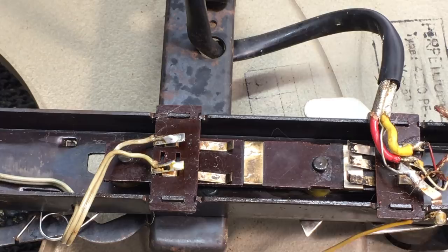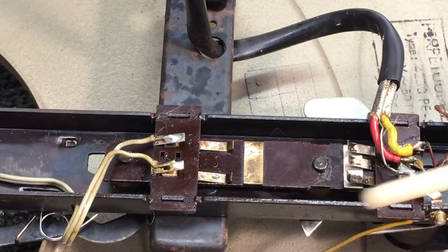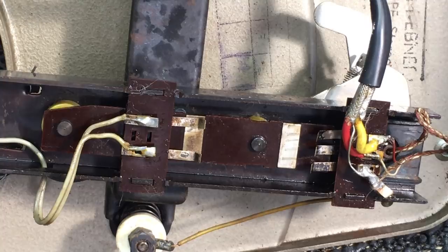Goes down into the shaft over there. So when this turntable is not turning, when it's off, the signal from the gramophone is actually shorted to ground, so you don't have any noise going into your gramophone input of the radio. When it's on, this thing moves up, releases that short, and makes the contact here so your motor can start spinning. So it's very simple, and I'll try and demonstrate here. There's the connection made. There's the connection unmade. Made.